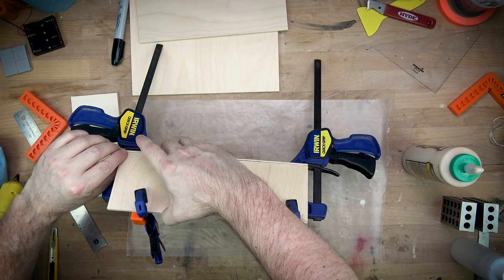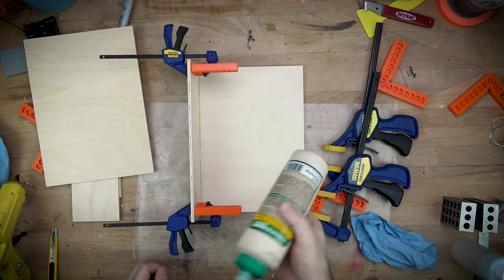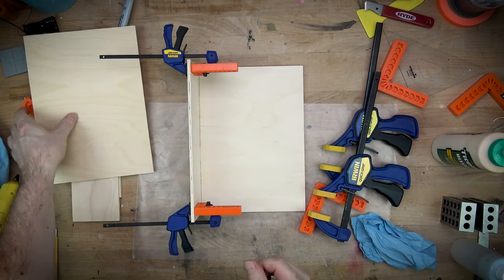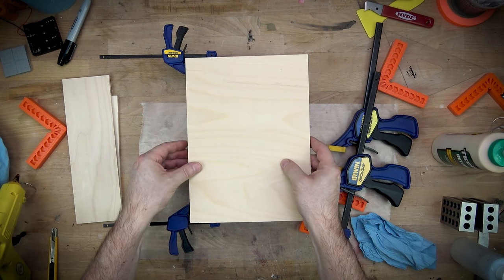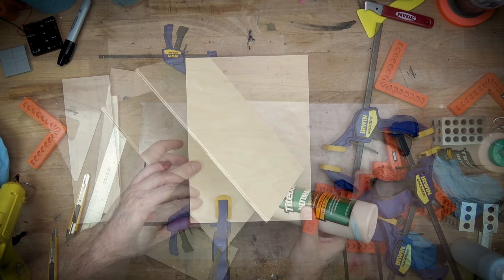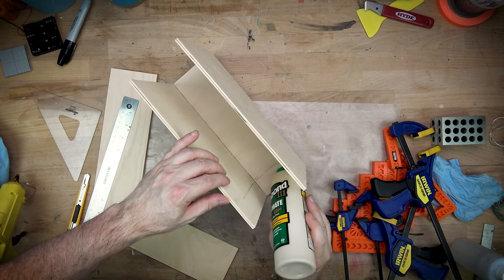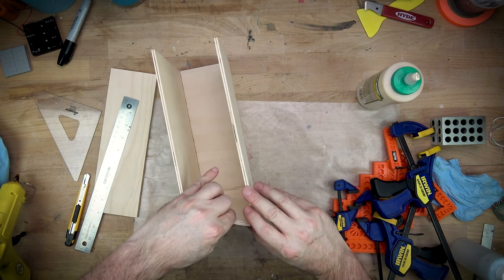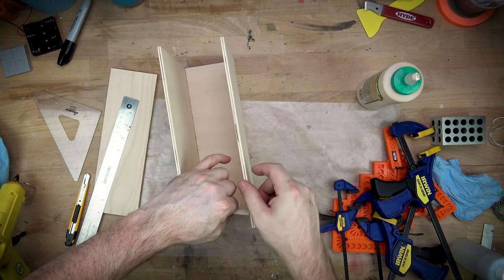One of the things I seem to consistently miss is actually planning ahead for the book nook — by that I mean finding the right places to hide wiring, especially for LEDs and lighting. I tried to have the back panel slightly recessed to have room for my Arduino microcontroller, but I completely forgot about where I was going to put the lighting in the ceiling. So we'll see later on I had to add some structures to help support and hide that. This one was a really tough one because there was a lot of geometry involved with the actual Pepper's Ghost and the mirror in the back.